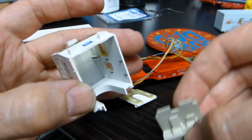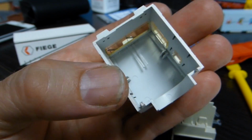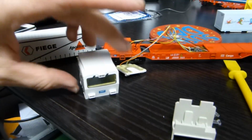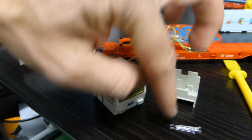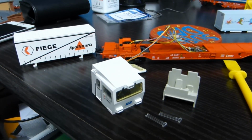Get access to the cab, and you can see the top light prisms inside. And what you've got to do is line all of those 6 light prisms up when you put it back together. It is a really really tricky job to do. One of the hardest cabs to get into that I've ever tried, because if you damage these light prisms, they're pretty much irreplaceable, because I doubt you could get spare ones for it. So you've got to be extremely careful taking it apart and putting it back together again.